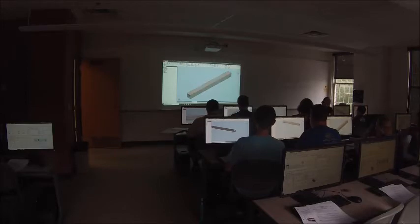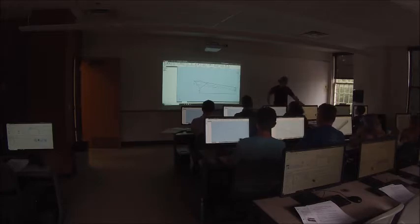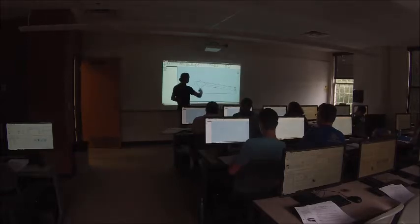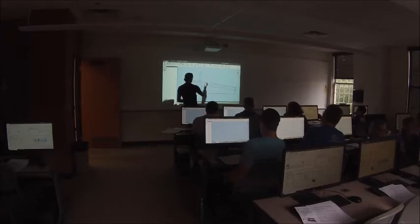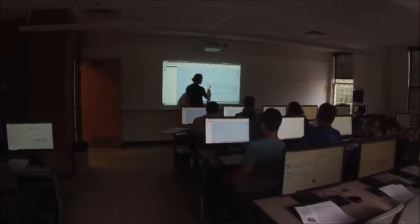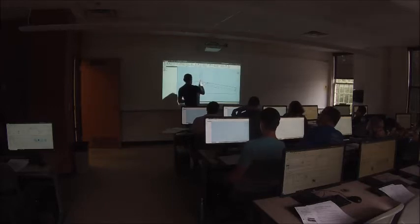Alright. So, let's go back to our layout sketch here for a second. Let's look at this. So, I'm going to draw on the screen again because I can. It's easy. All right, so if you're looking at your sheet that has the example, that hole that we just created is here. This is where the bushing is. That's where the pivot is. So that tube that we just made in the vertical position is going to be like this. Now we need to, this is in the retracted position. The retracted position, this is where the pin of the clevis of the air cylinder is. So we've got to attach that pin to this mechanism somehow.